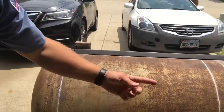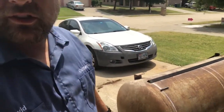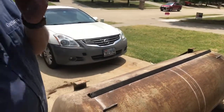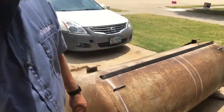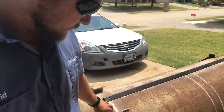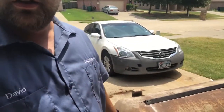This is just soapstone, so I want to get them marked out. That way if it rains, it won't wash my mark off and I won't have to start all over. As a guide for the top, I tacked on a piece of angle iron here, so it's going to be my straight edge. I don't know what I'm going to do with the sides — I might have to freehand them. Hopefully they come out straight, but it doesn't really matter if they're a hundred percent straight because I'll be welding a piece of one-inch strap all the way around them, kind of like a seal for the door.